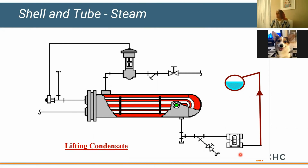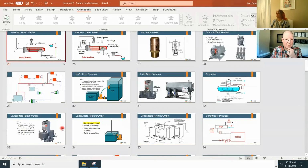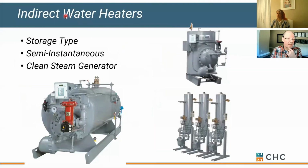Is clean steam the only steam that is recommended for humidity in air systems? Oh, another good question. With clean steam, it depends how you're humidifying your air. With clean steam, we're taking dirty plant steam that's chemical laden and simply running it through a coil. There's a U-bend coil in here, and we're surrounding it with RO or DI water to generate pressurized clean steam that you could use for humidification or blow directly into your air handler coil for distribution. There's also point of use, so you could get individual units that generate very low pressure steam or 0 pound steam that you could use for humidification.